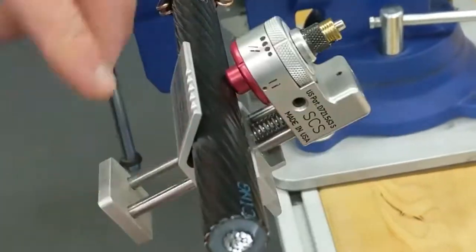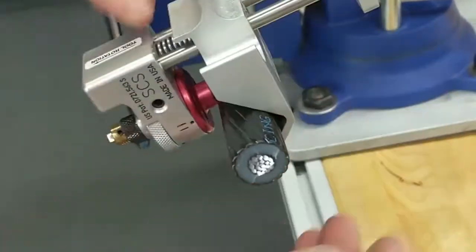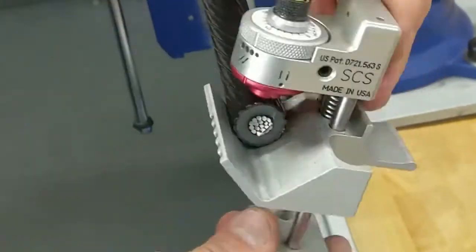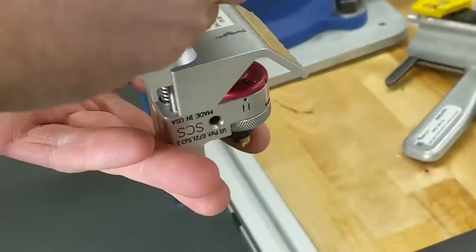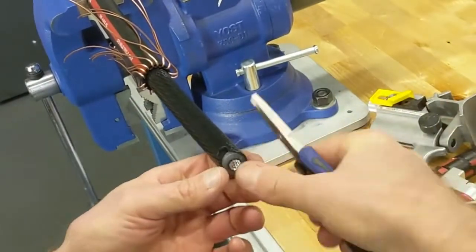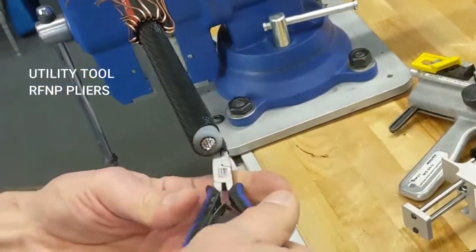Do the ring cut, then set the tool to a spiral position based on the cable diameter. You have full control over the chip width by picking one of the four speeds. Once you reach the end of the cable, carefully remove the tool from the cable.